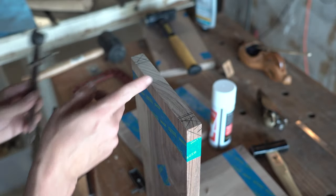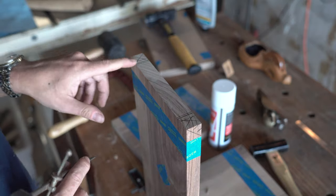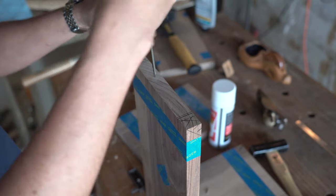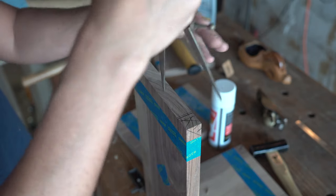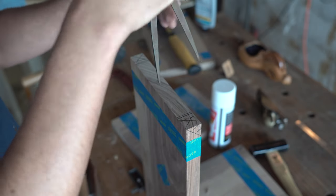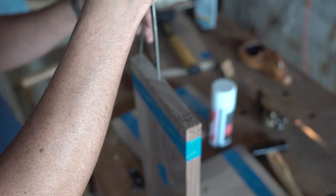And then from here, a way of coming up with your middle pin is actually kind of the same way that you would lay out standard dovetail. So you want to come on the outside of your pin. And the idea is that you want to walk your dividers to your next pin. So obviously this is way too short. We'll spin that out. Way too far. And this is just a process of trial and error, kind of coming at it close. And you want to make sure that you're walking to the inside. That's really close. Let me just tighten this up just a smidge.